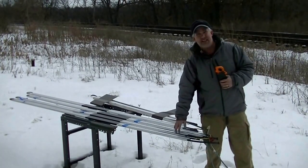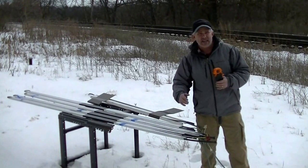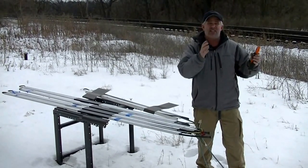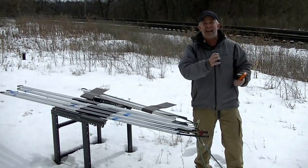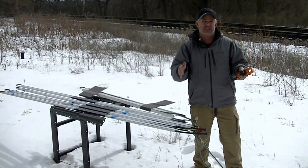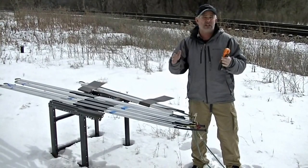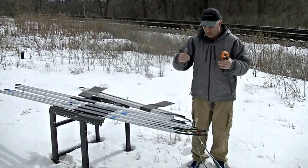In the center is our 8-watt cable, our 13-watt cable, and our 15-watt cable — those are just basically names. The way heat cables are tested is with ice baths: the cables are dumped into supercooled ice baths and they measure how much wattage they can extract. That's great for testing and very consistent, but it's not real world. What we're hoping to imitate here is as close to a real-world simulation as we can while keeping the parameters concise.